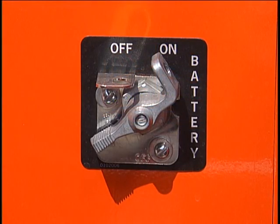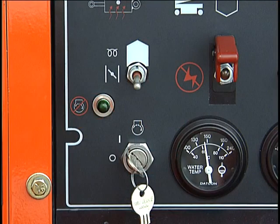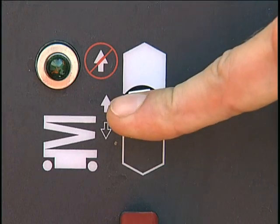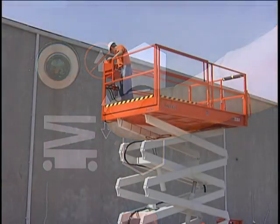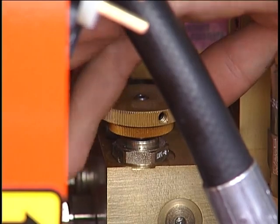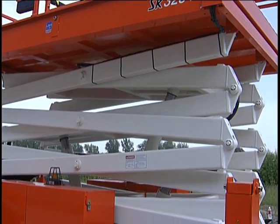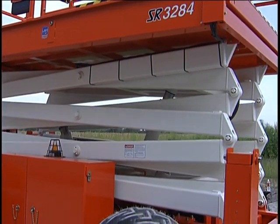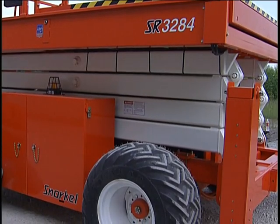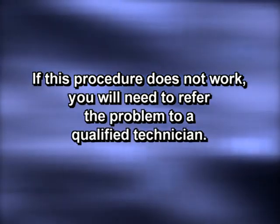That person should make sure the battery disconnect switch is on, that the emergency stop switch is not engaged, and that the start switch is on and the selector switch in the lower controls position. Then try to lower the platform from the lower control panel. If it will not lower, reach through the opening immediately below the lower control panel and screw open the emergency bleed down valve. The platform should lower. You can control the speed of descent or stop it with the valve, but you will not be able to raise the platform with the valve. When the platform has completely lowered, close the valve. If this procedure does not work, refer the problem to a qualified technician.